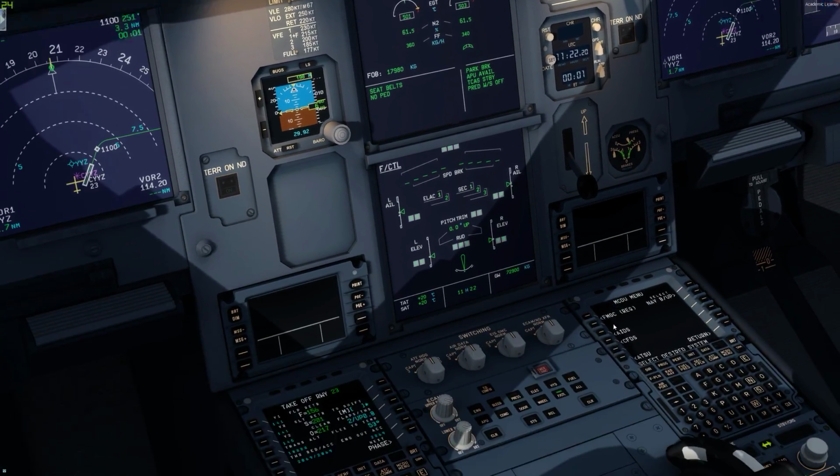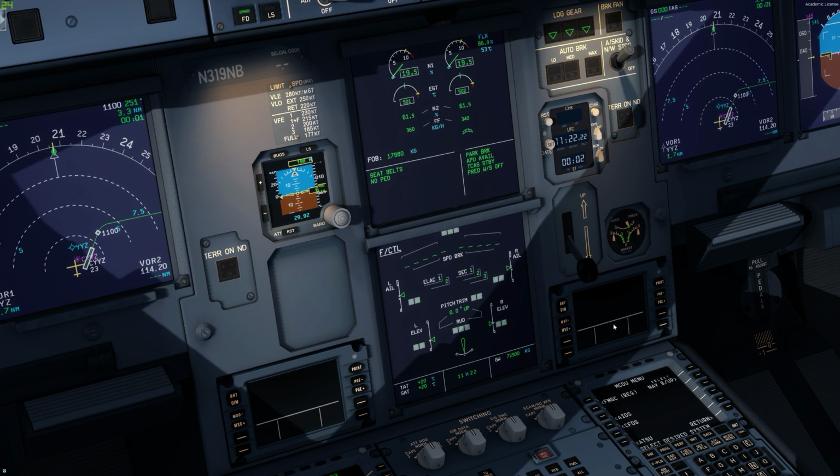Alright, we're going to test the flight controls. You want to bring your yoke, or, I mean, you're going to bring your stick, or God forbid a yoke. Go to full left. Make sure your speed brakes on the left wing are deployed. Right aileron is down, and left aileron is up. Center that. Bring it to the right, make sure it's the same. Center, pull back, make sure your elevators are back. Center and push forward, make sure they're down. Good. Now test the rudder, full left, center and full right, and center.